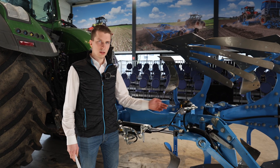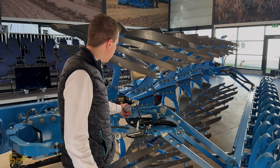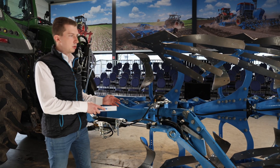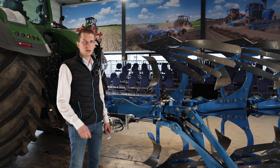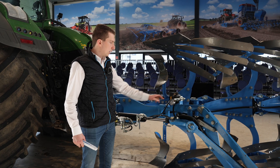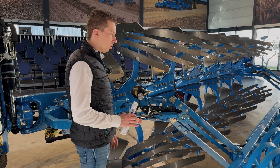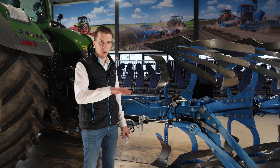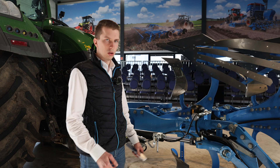Taking a closer look at the hydraulic system of the furrow press, you can see different cylinders and manometers. With this manometer you can see that you can transfer weight from the plow to the furrow press so you can react to different soil conditions — you adjust it with this valve and act your spool valve to get higher pressure in the hydraulic system. And if you don't want to use this furrow press, you can lift it up so it runs over the soil surface and you get only normal plowing.